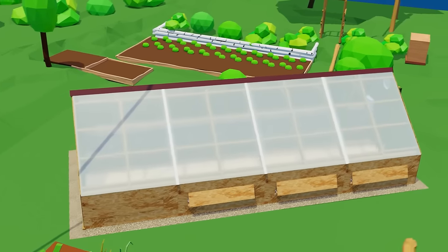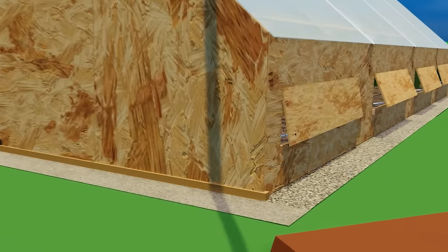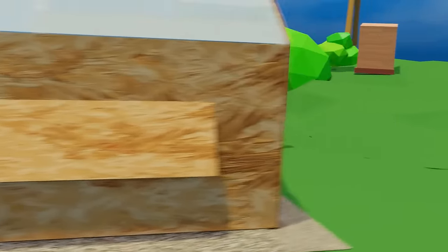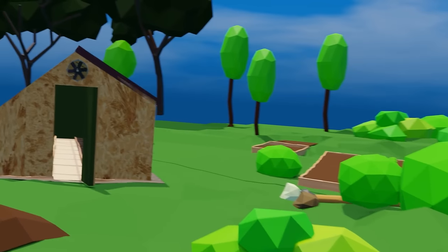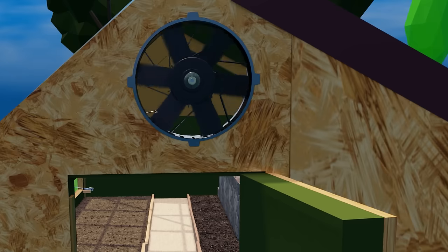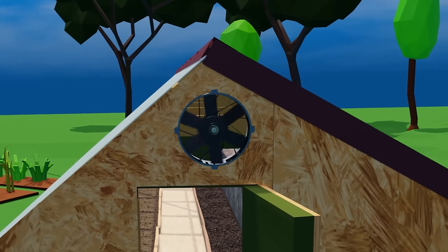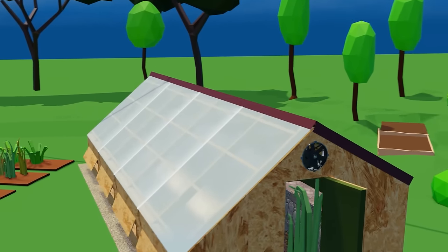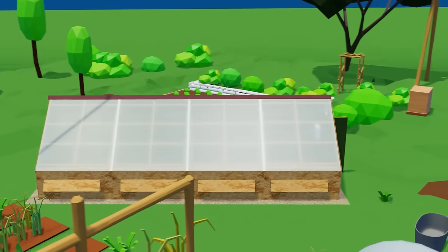The sixth consideration is ventilation. In order to cool the greenhouse during hot summers it's important to have proper ventilation. I plan to include windows on the lower front side for natural airflow and also install one or two fans on the east side to exhaust hot air. These fans will be controlled by a thermostat and powered by solar energy, making the most efficient use of energy during the hottest days when it's most needed. I may also consider incorporating geothermal cooling at a later date, but for now I want to focus on those two basic methods.